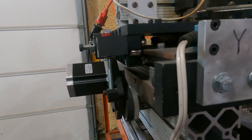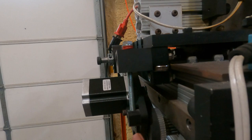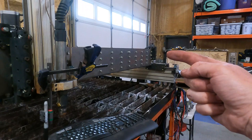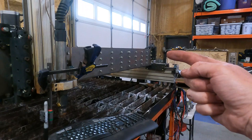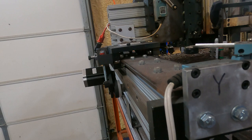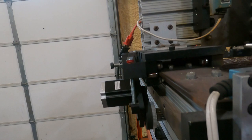I realized I didn't actually have any footage of the functional repair - and it's all BS until we see it working. Here's the motor that went bad, the one we replaced with the new shaft inside, and this is the belt that was just hanging down because the shaft had broken off. Here's the little gear on the end of the stepper motor that had sheared off. This is a dual-drive gantry, so when this motor lost its shaft, the other motor was still trying to move and it was jamming up, making all kinds of grinding and skipping noises. Now it's a functional motor - slow speed, high speed. There's our repair. Don't know how long it'll last, but the repair worked.